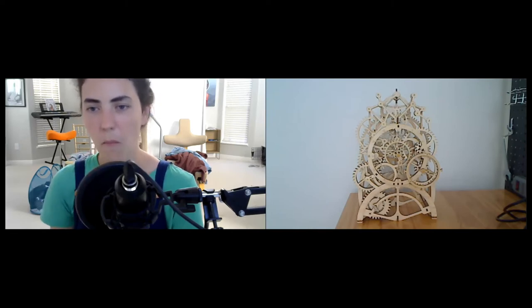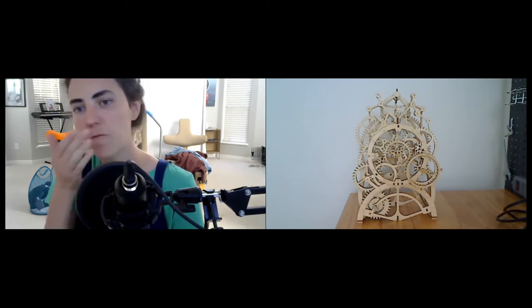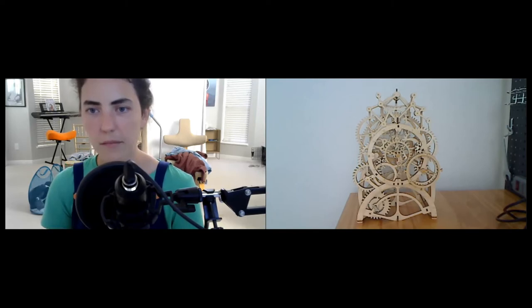The little rocking thing at the top is called the anchor escapement mechanism. The top looks kind of like an anchor, and the toothed wheel that goes jerkily is called the escape wheel. The way a pendulum clock works: at the bottom left you can see a metal key — that's the wind-up key. When you wind it up, there's a ratchet gear and a main spring. Without the pendulum and rocking mechanism, the whole spring would just unwind immediately. What the escapement does is periodically let the gear train escape and then capture it again. The toothed wheel catches the notch and stops, but the spring is just strong enough to push it out of the way, giving the pendulum a little push, and then the pendulum swings back and traps the escape wheel again.